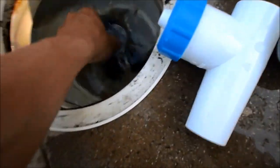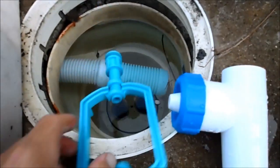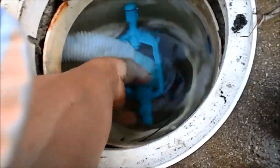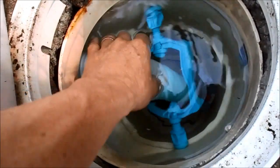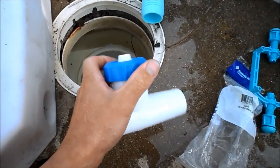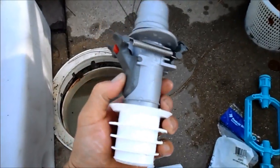If you don't have this part, you may not get the right suction because there'll be room around the sides for water to get through. This is made by Pentair for the Kreepy Krauly but it works on all the cleaners. You stick it in and put the hose through it, wedging it so it locks the skimmer adapter down. That way when the pool turns off, it won't pop out and float. You also want to make sure the skimmer adapter has the right amount of flow for your cleaner — they're all adjustable. The Zodiac one is more automatic where it'll open up and self-adjust the flow.